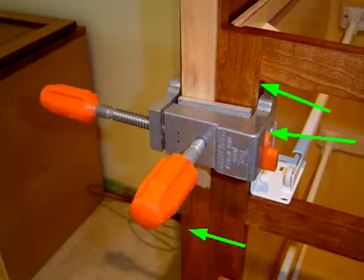You'll want to have three screws for a wall cabinet or a base cabinet. If you're a do-it-yourselfer and you're just doing one kitchen, I recommend that you just use a drill bit to pilot the hole first, and then put whatever kind of screw you've got into this.